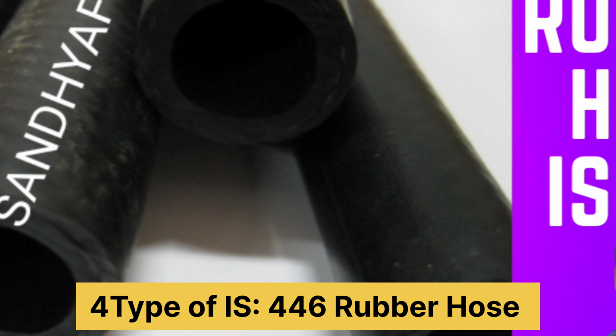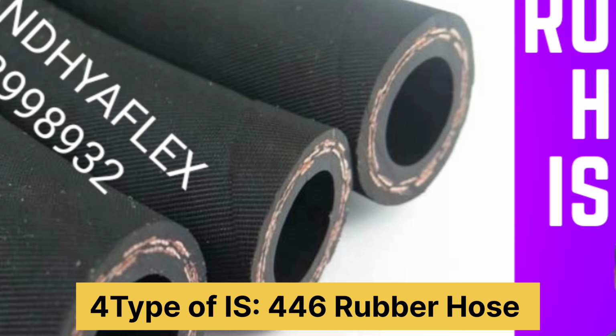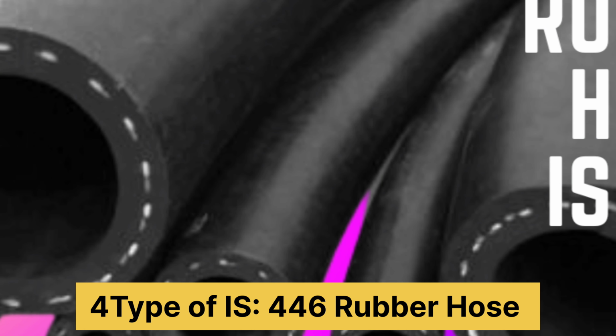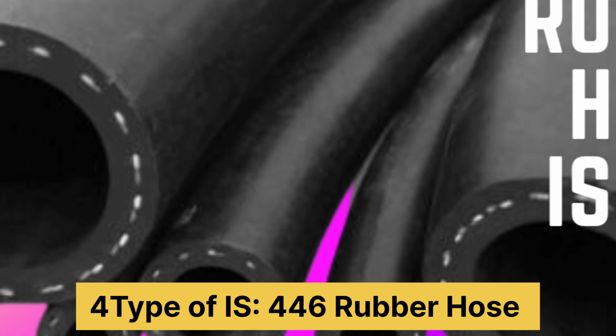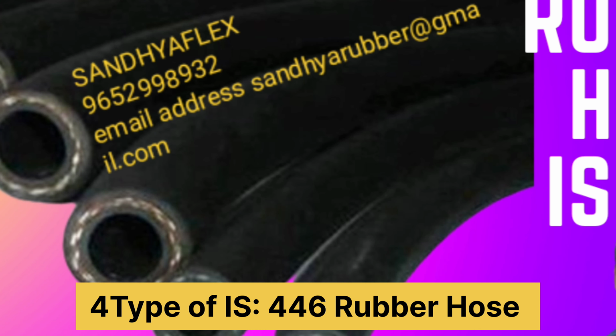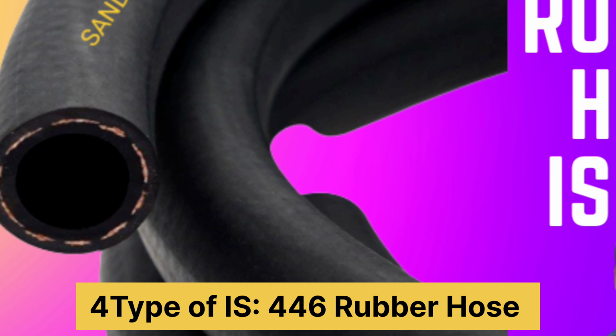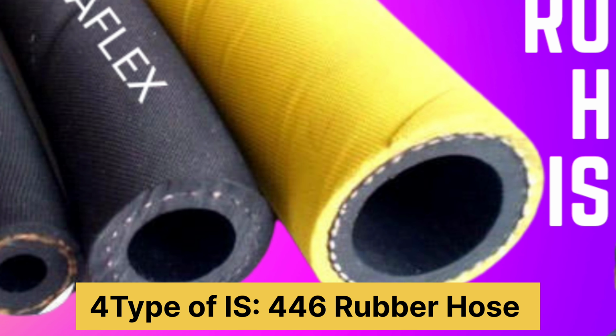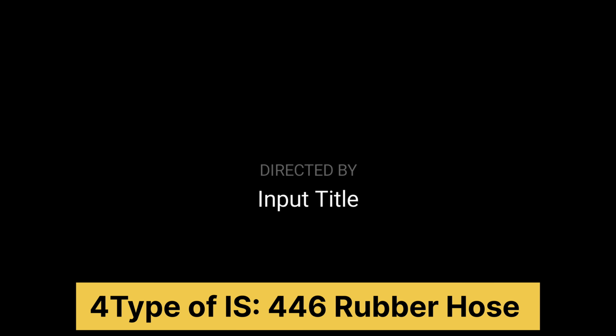If you go through, the minimum dimension is 10 mm and the maximum is 100 mm: 10 mm, 12 mm, 16 mm, 20 mm, 25 mm, 31.5 mm, 38 mm, 45 mm, 50 mm, 56 mm, 63 mm, 75 mm and maximum 100 mm. For 10 mm to 20 mm, the bore size tolerance is plus or minus 0.75 mm.